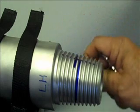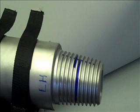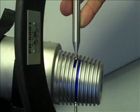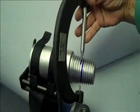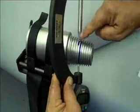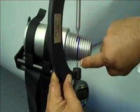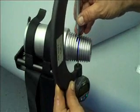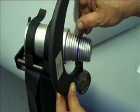So this is going counterclockwise a half a pitch around, but because you don't want to climb inside the machine, it makes it easier. Then I still follow the same process. I place the fixed point onto the mark. We're going to zoom out a little bit. You see the indicator. I still have the fixed point on the mark. Now, I'm a half a pitch down the taper, but I'm actually on this groove going counterclockwise. Then I sweep to the lowest reading, and this one is reading a -1.